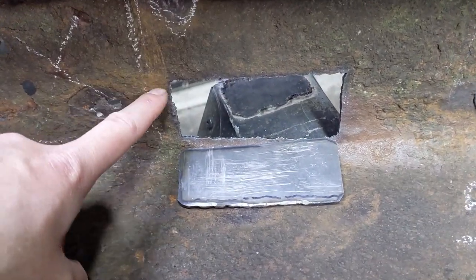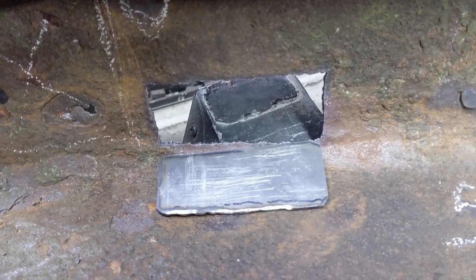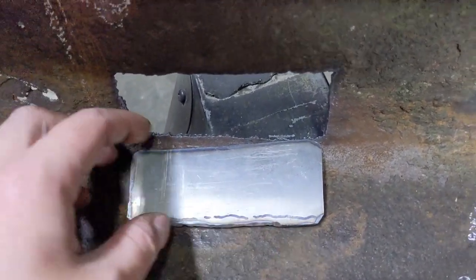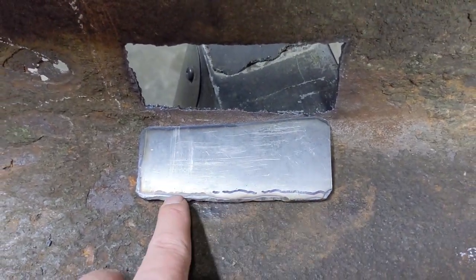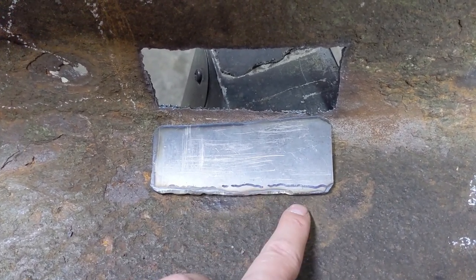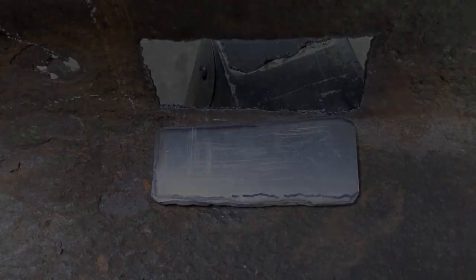As I mentioned in part one, I was just cutting out the areas here freehand with the plasma cutter, so the cuts aren't as perfect. But once we do get these pieces cut out, I'm just laying it in there and then taking a permanent marker and marking an edge where I think I need to cut. Then I'm freehand cutting these pieces to trim up, and any smaller areas I'm taking to the bench grinder.